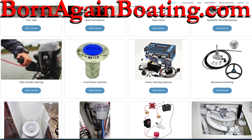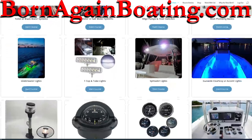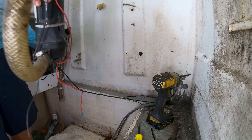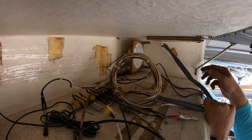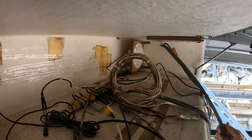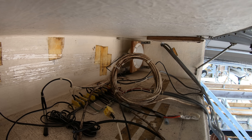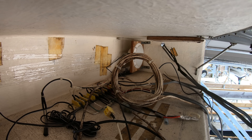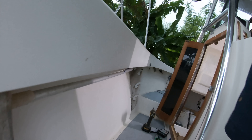The best way to rewire a boat is to start with a blank canvas. That means you've got to pull every single thing that is in the boat out of the boat, but it's crucial that you don't forget to also run pull strings through all of the rigging tubes when you do so, as well as anywhere you are going to need to pull a wire to, like up here in the front of the bow or over to the gunnels of the boat.